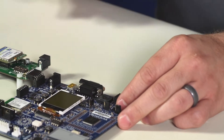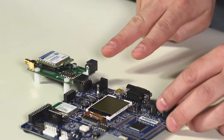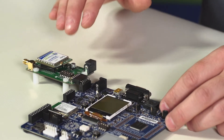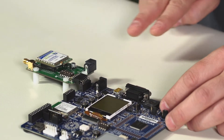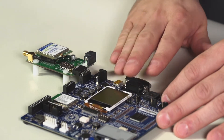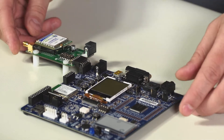The adapter board does come with a Y splitter that allows you to plug in two power connections. The modem itself can require up to 1 amp of current during transmit bursts on the cellular network. So we provide a splitter so that you can split your 5 volt power supply to both the Renesas board and the RL78 adapter board.